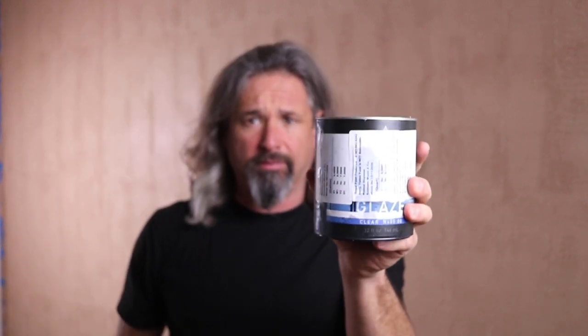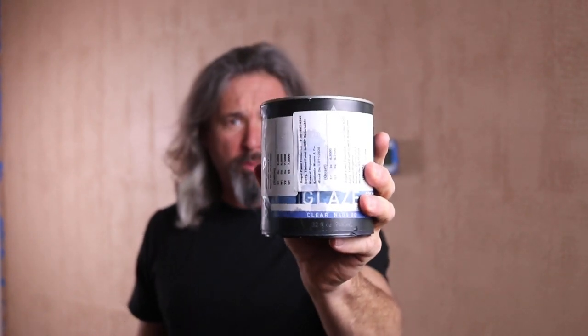All right, so here's where we are in the process. We base coated the surface using the 1-2-3 primer, tinted to the base color, and it's dried. I put 2 coats on. So the next part of this process is the glazing technique. We're going to need our glaze. For this one, I'm just going to use a Spectrum wall glaze. Definitely going to need some more tape, okay? Tape. You need a 3-inch paintbrush.